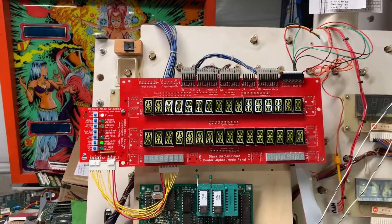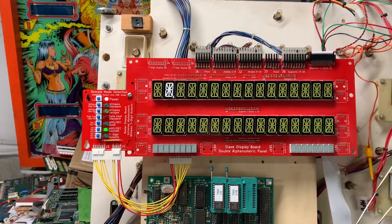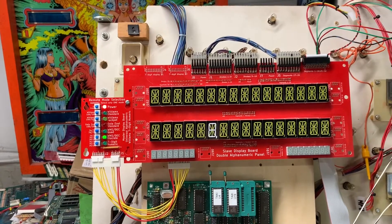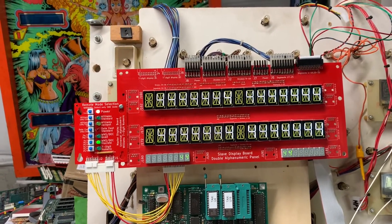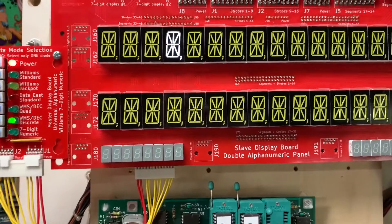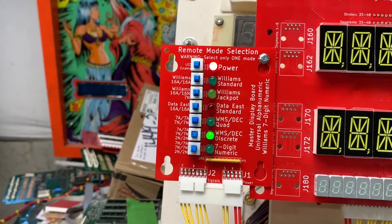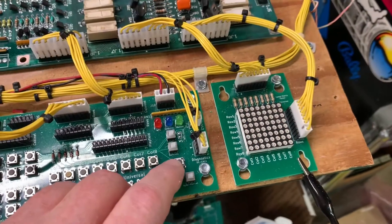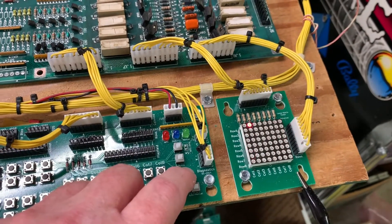I'll put this in my High Speed to test. You can see this is a rev 2 of dumbass's master super duper display panel, and it supports all games — System 9 through 11 and Data East — correctly. This is a High Speed, so the credit, ball, and play displays are down there. I've got a front-accessible control panel here. The next test is sound, but we'll skip that for now. Lamp test — we can go through individual lamps. Yay, lamp matrix working!